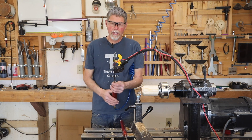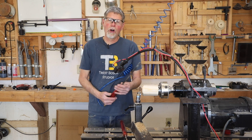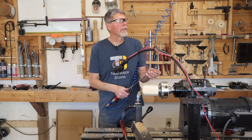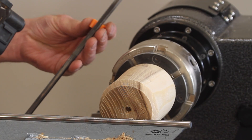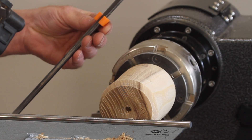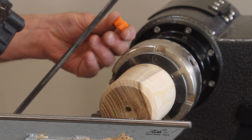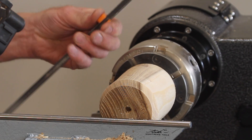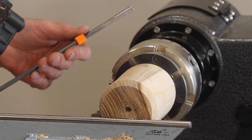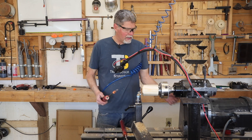Another thing to share is how deep you want to drill. If we don't have any kind of mark, we could drill way too deep and end up with a hole in the bottom of our piece. The gun drill comes with little stoppers that mount on the tool — you hook one side, pull it around, and it snaps in place. To remove it, you pull one side off and spin it around. They slide along the gun drill to whatever distance you choose for your hole depth.